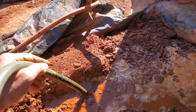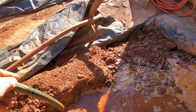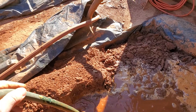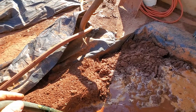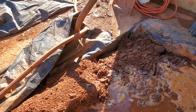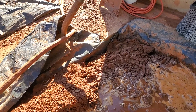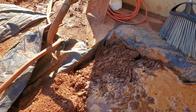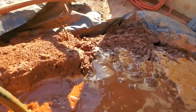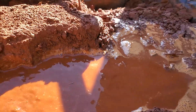We're compacting this with water right now. I did this on a house with gravel and I compacted it every one foot with a compactor, then I flooded the house with water from a pond out front. Even after I compacted the four-foot-deep trench in one-foot lifts, it still went down a foot just using water. So I found water is one of the best compactors — and you can already see this right here is going down about two inches just by doing this.